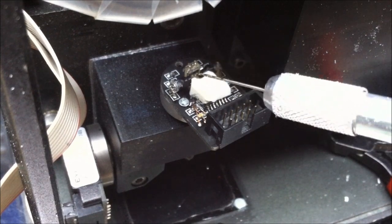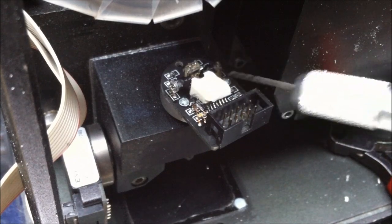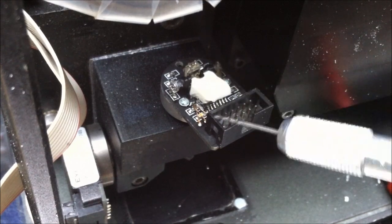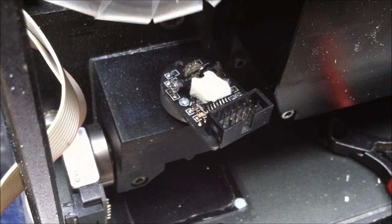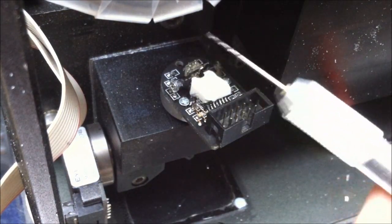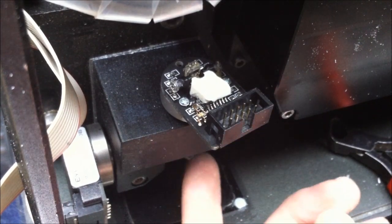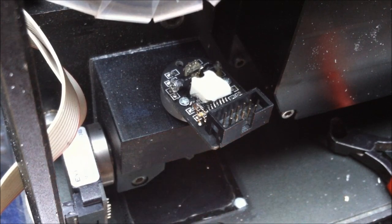Now I'm going to tell you, if you are doing a little pin inside of the Galvo there, you're going to need a hardened steel pin, because it just swished that LED lead around the shaft. No problem. Lots of kickback on that galvanometer. So I got a little stainless steel pin from one of the little drone motors. So one of these little shafts, and just got it in there. I had to drill it out, get all the glue out and stuff like that. But now that pin is in, and the Galvo does move. I don't know if you can see that little movement in there, flopping back and forth, but it does work.